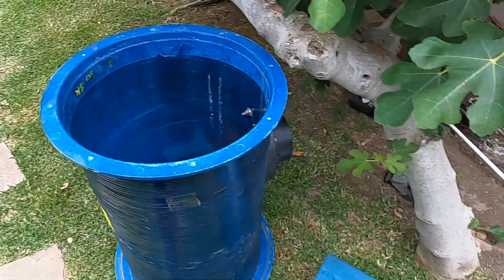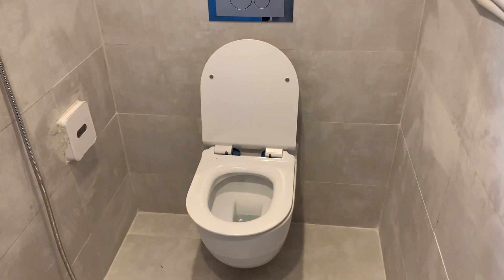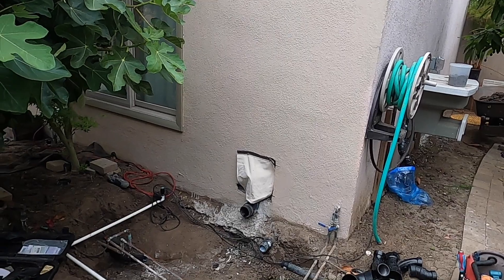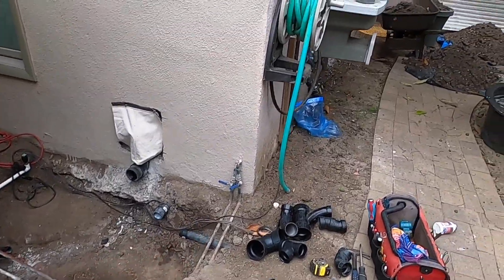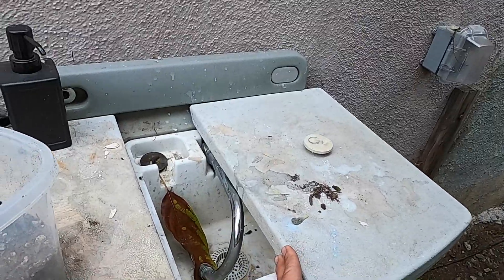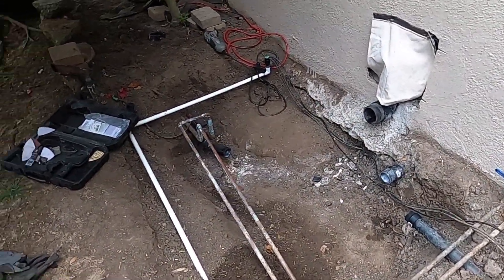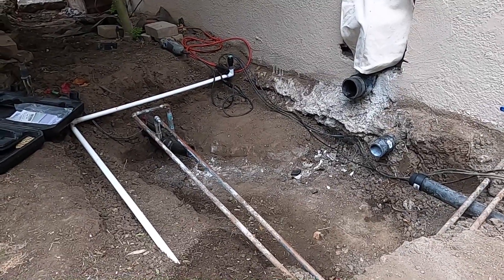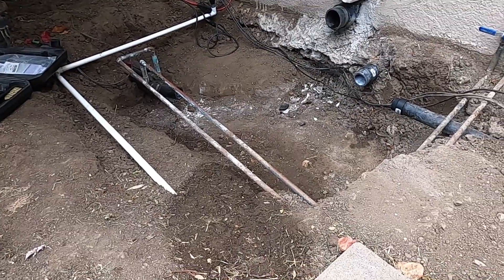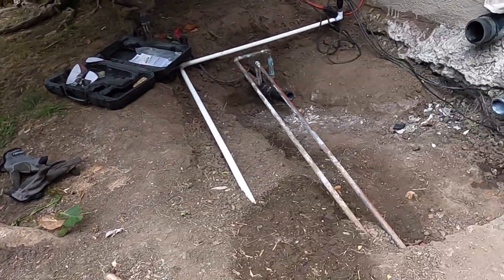Here's the basin we're going to be using, and a pump's going to go down below. Right here is a bathroom inside that the other plumbers built. They could not figure out how to drain the system because it could not be gravity drained. So I'm going to install a sewer ejector system in this area. There's the toilet area, one outdoor sink, and then a third pipe for the floor drain and lavatory sink. Those three ABS pipes we're going to connect up into the system, which can accept toilet sewage and other water and eject it into the regular drain system underneath this person's house. We're working in a garage area and going to start digging right here.